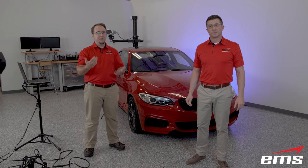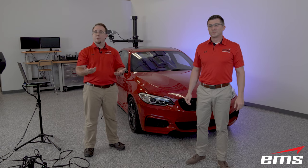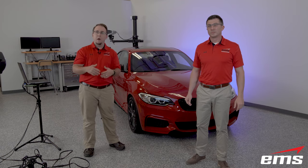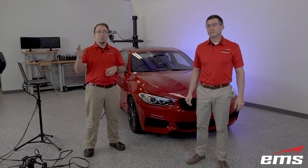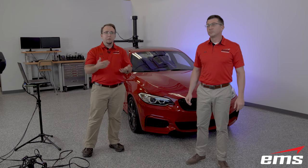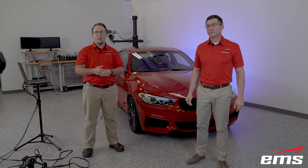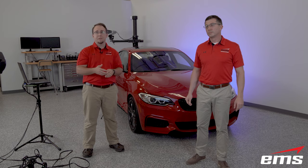The Black Elite's resolution is approximately two times greater than the prior generation, meaning users will be able to view greater detail in their scan data that other scanners may miss. Another great change Creaform made is switching the laser lines from red to blue. The blue laser scatters less than red, which has a big impact on certain surface types like shiny, reflective, or polished materials, making capturing these surface types even easier with the new Metroscan.